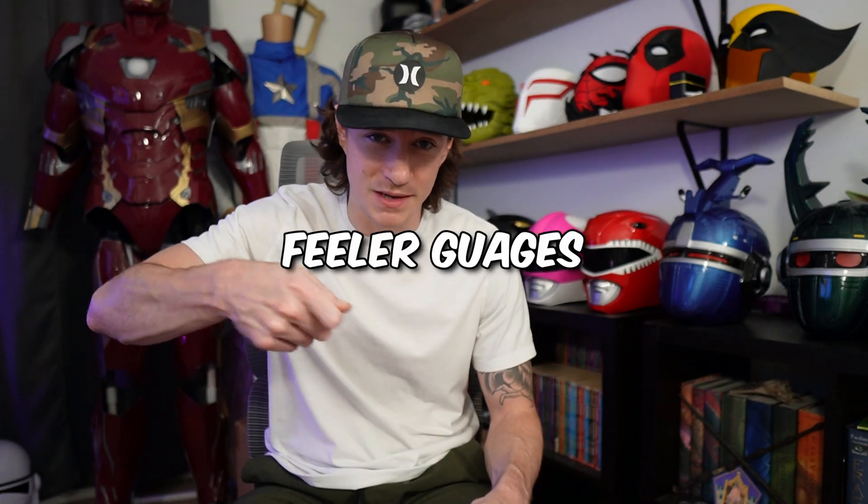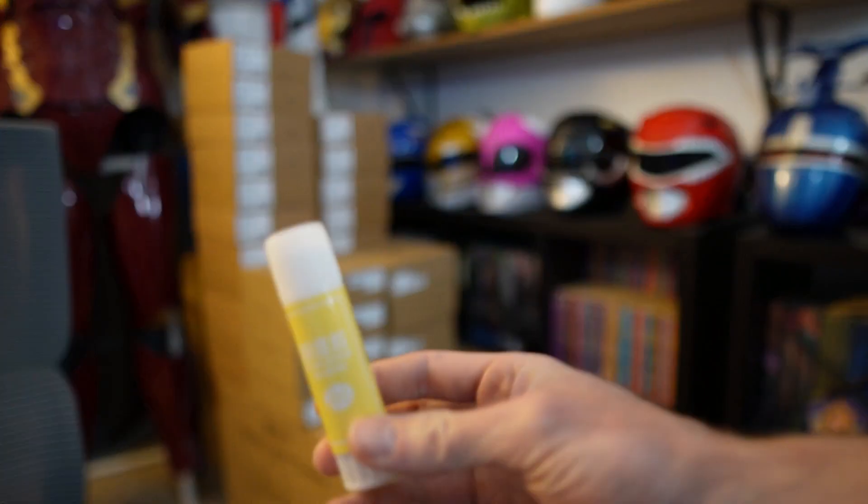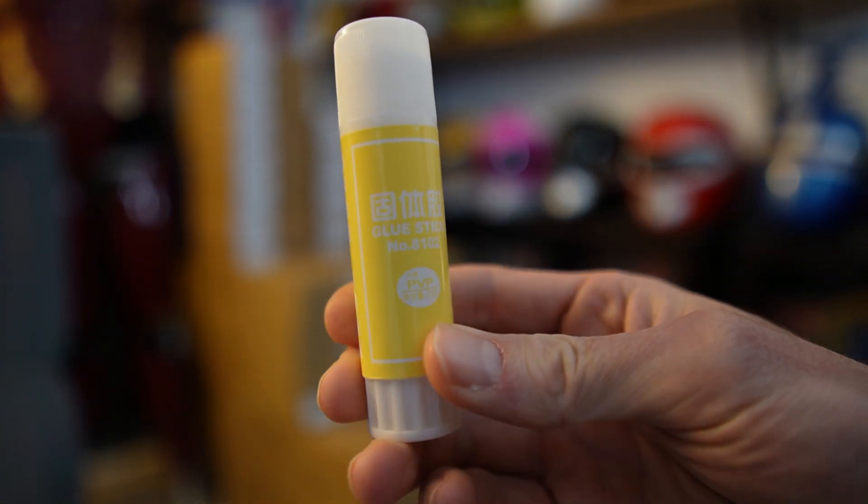With the Elegoos I've struggled with bed adhesion no matter what and went back to the paper test. I used to also use little metal shims to get a perfect 0.18mm offset from the build plate, but that didn't work for me. The paper test worked way better — going around all corners and bed leveling it. And use the glue stick. I know everybody wants to be better than the glue stick, but they pack it into the printer for a reason. It seriously helps, and even the K1 Max directions tell you to apply the glue stick. Don't let your ego ruin your prints.